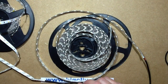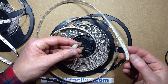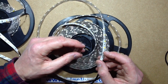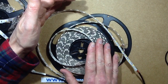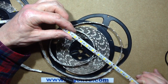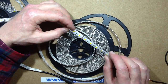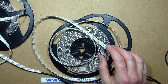The actual current was 2 amps, which wasn't too bad. I measured the voltage drop under load from one end to the other, and it dropped by 0.7 volts. Again, it shows that although this stuff comes in 5 meter runs, it's probably better not used in 5 meter runs. It's a good idea to use it in shorter sections if you want the full intensity and more even illumination across its length. But other than that, it's neat enough — I'm going to maybe install some as under-shelf lighting to see how it looks.